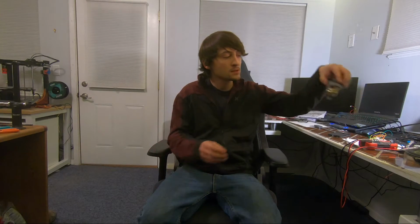Alright, and on the topic of the speakers, we have the resin-based 3D printed speaker, which is a lot more compact and smaller than the previous versions of the speaker, due to the fact that the resin printers are so much more precise, and you can get so much thinner on walls. Some of the stuff that I've done is I've reduced the moving mass of the actual coil and surrounds and cone, and then I've also added a pole and then two plates. And I went with a 3/8 bolt, and then the plates are 5/8 washers, which seem to be the perfect size for all of this.